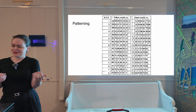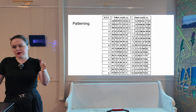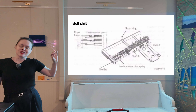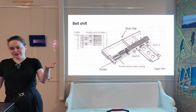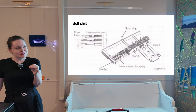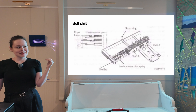The way we deal with this limitation is by keeping track of where the carriage is on the bed and setting the needles and updating the solenoid buffer a few needles ahead of the carriage. But it's not quite that simple — because it never is — because of belt shift. While the solenoid buffer is 16 bits, the physical patterning mechanism underneath the machine bed can only manipulate eight stitches at a time. This is where belt shift comes in, and it's the sensor value we get from the machine.